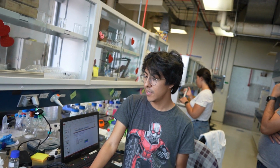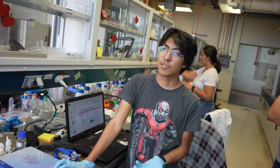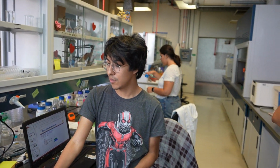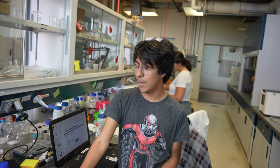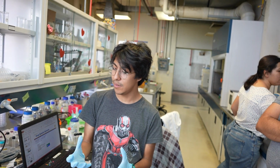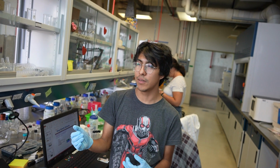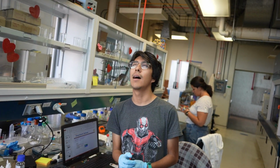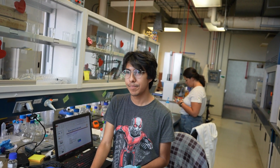The disadvantage of these materials is that they have a low melting temperature because they are made of gelatin. So we can use them at lower temperatures. We can still measure change in resistivity at low temperatures. The plan is to keep using the same solvents, but maybe change the polymer, in this case gelatin, for a material which has a higher melting point. But the main goal is to improve sensing and wearable devices technology.